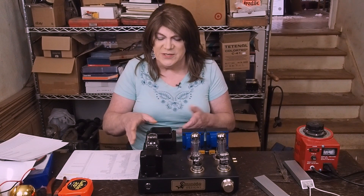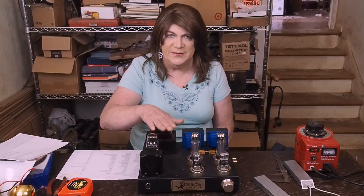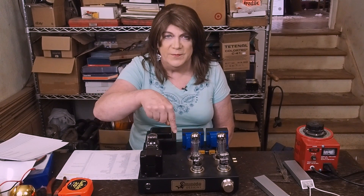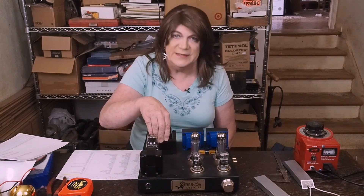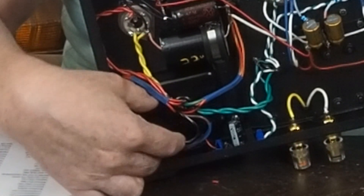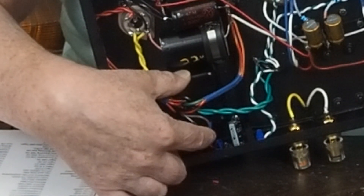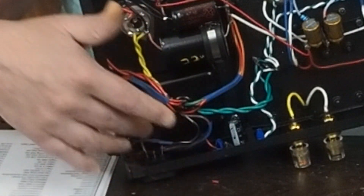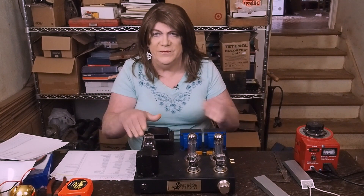The standup transformer also helps with chassis fabrication. With the laydown type, you not only have to drill the mounting holes, you have to saw out a square opening because the transformer sits down inside the chassis - one bell is inside the amplifier and it takes up a lot of room, making it difficult to wire the power supply. If I go with the transformer where everything is on top, all I have to do is drill the mounting holes and two holes for the wires - it makes the top chassis fabrication a lot easier.